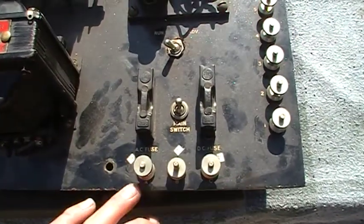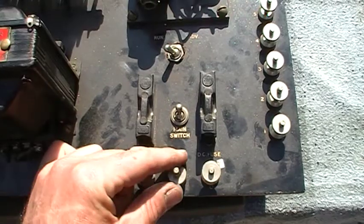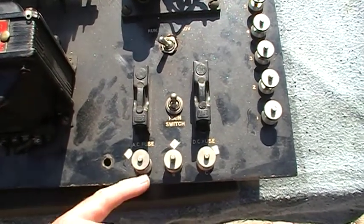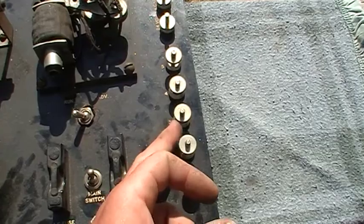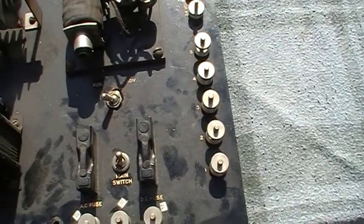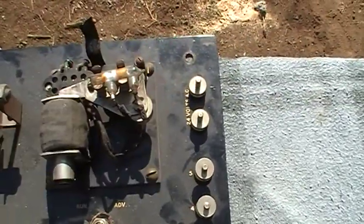These three outputs here go out to your wind circuit on your master clock — A and C — and the B circuit would be connected if you have a pulse accumulator. They also go out to your slave clocks around the building. The 1, 2, 3, 4 and 5 connections are for the switches from your master clock, and there's a 24 volt tapping here if you want to run bell circuits.